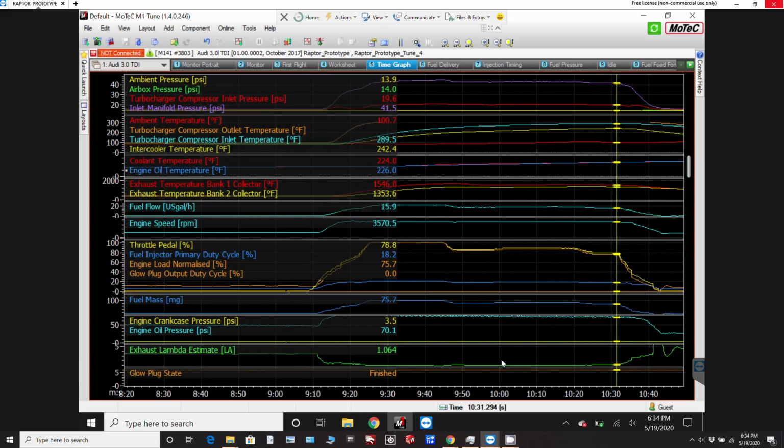If we end up getting a 1200 foot per minute rate of climb, and we've got a minute and 20 seconds, we're going to be getting around 1600 feet in the air before we have to pull the power back, and that's based upon no cooling here. So once we have cooling, we'll find where the sweet spot is there, and maybe the power will be back at 70%, and it'll depend on the deck angle for climb out. But Justin is expecting to take the aircraft up to 10,000 feet for the first flight, so he'll establish a climb that's comfortable for temperatures and then just keep going.